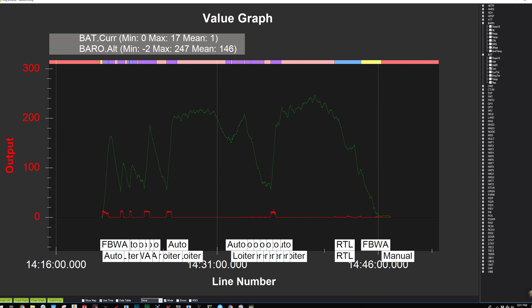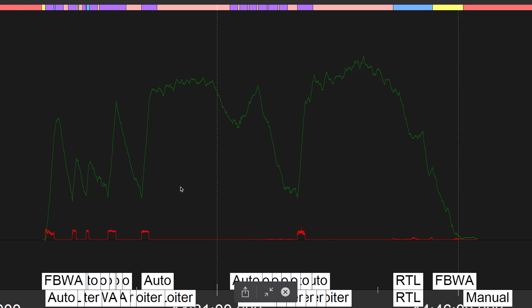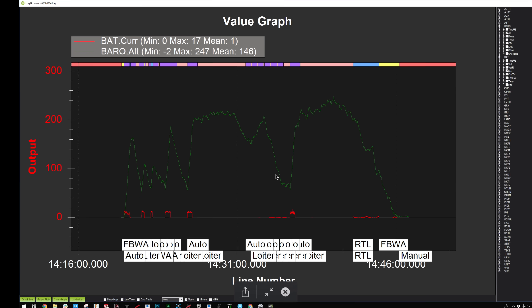There was wind probably ranging from 5 to 10 miles an hour that day, so I'd expect the thermals to be blowing across the ground. But this doesn't really look like a thermal blowing across the ground. I'm going to go on the record and say that this plane was not actively tracking a thermal as it moved downwind — it was just circling and getting lift because there was a ton of lift. So I think what I need to do is increase the soar minimum vertical speed setting so that it finds fewer thermals, but the thermals it does find are stronger, and then maybe we'll see some real altitude gain performance instead of just kind of drifting along randomly. Here we have a graph of motor current and altitude. You can line up where these little red nubs are — where the motor was on — and the green line is altitude. Every time the motor turns on it climbs pretty steeply, then the motor turns off and it kind of goes up and down, getting lift from thermals. Right here it's definitely gaining lift with no power at all from the motor — then it goes down, gets a little spike of lift, then down again.